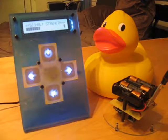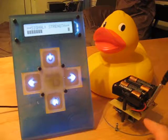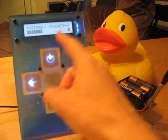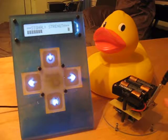There are a few other functions to this project. The first one is that you can see the signal strength. Each time the detector sends a frame — each time the green LED is on — you can see the signal strength going up. The detector uses the power-down function of the RF transmitter to save energy, which is really important for an embedded device.